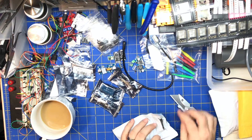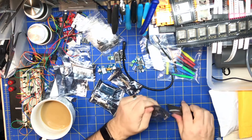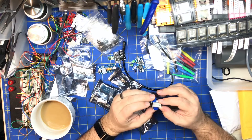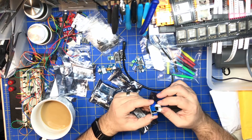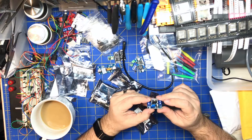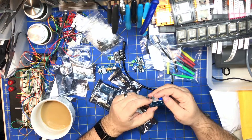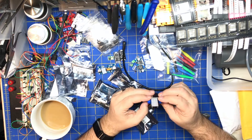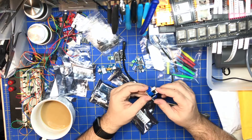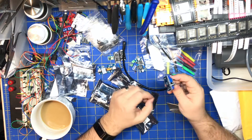Next, PC board. I don't know what this is — another probably converter, just kind of flapping in the breeze there. This is some kind of LM317T — V in, V out. Probably adjustable voltage regulator with a pot. Just a different kind.